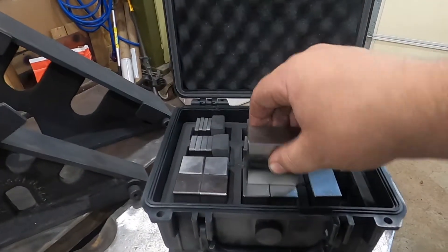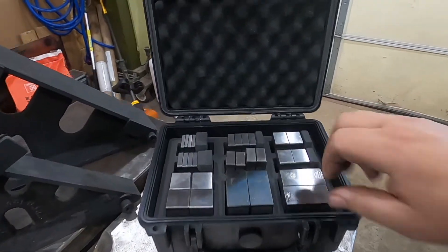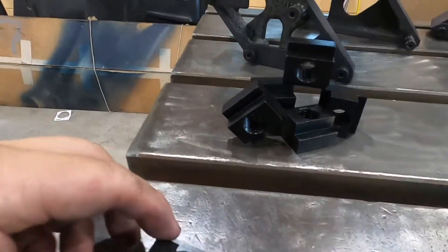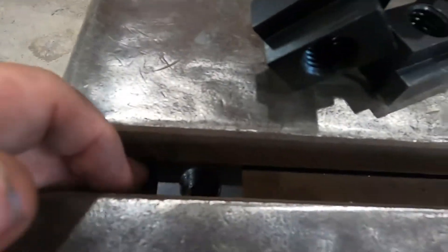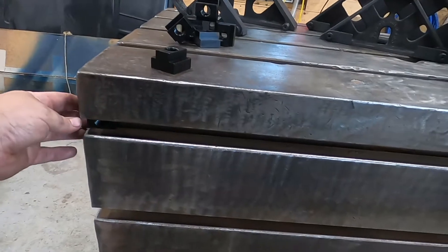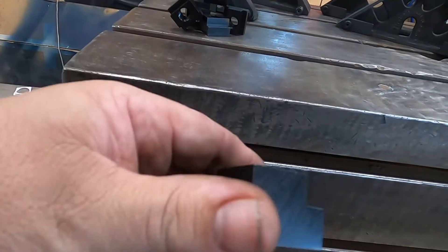I have an acorn welding table that I bought — it was a 5x5 — but the real estate's kind of tight here at the old East Lake House of Speed. So I ended up coming up with this idea because this is about a 24x48 footprint, and using it as a radial arm drill press table for machining ops, it's got these T-slots here. That allows you some different fixturing ideas you can come up with. These are some 7/8-inch T-nuts that have 3/4-10 bolt holes in them, so you can use different strap clamps and stuff like that you would see for milling ops. With that front 90-degree there, it gives you a lot of options for fixturing and jigging up.